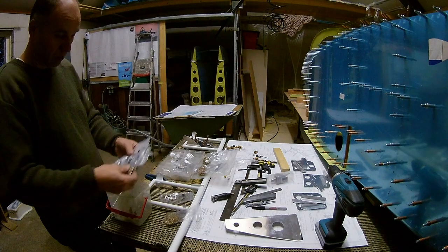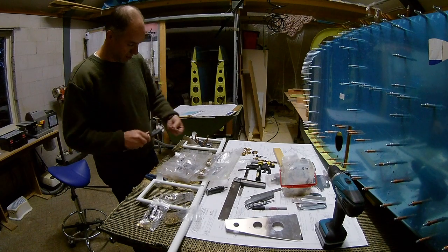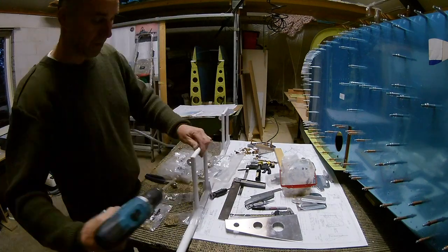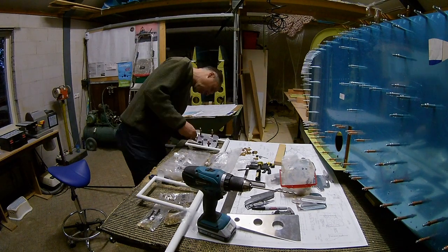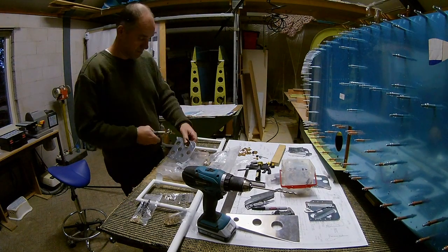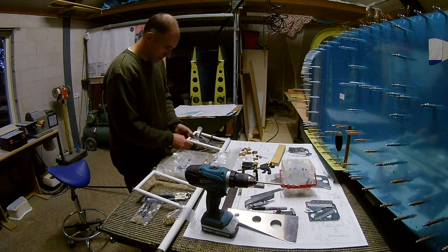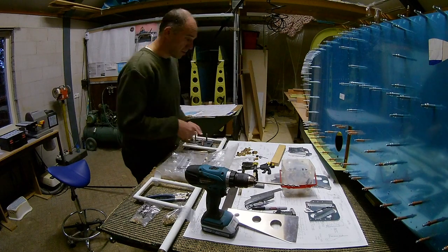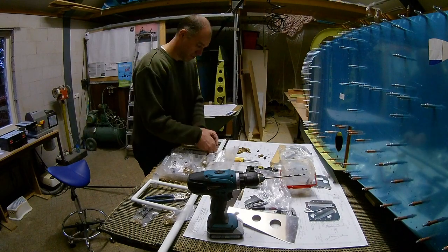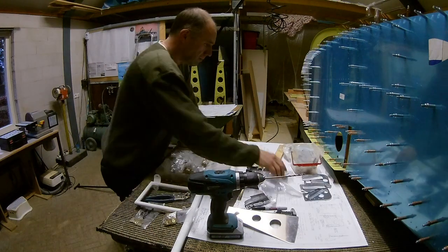I don't think I have the correct nuts. The instructions say to install AN5s, but in the second bag for the right side there were also four AN4s. On one side you have more distance to cover than the other because it's only a single angle, so you actually need a mix of AN5s and AN4s. In the official kit there's only AN5s, and I'm not willing to use extra washers. So I'll order some extra AN4s with the next kit order and then replace the AN5s I'm using temporarily.